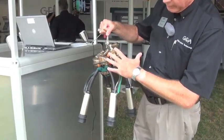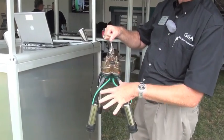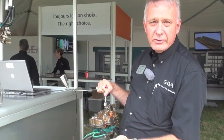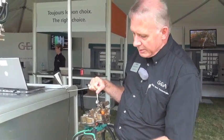That dipping happens just before the unit comes off the cow. Then it's hung upside down in the milk parlor, and it flushes — the valve goes down and flushes the unit out with a sanitizer, then water, then air, and then it's ready for the next cow, cleaned and sanitized.